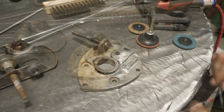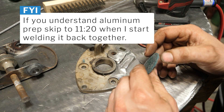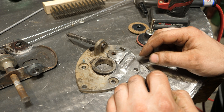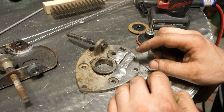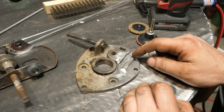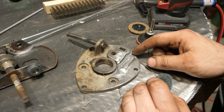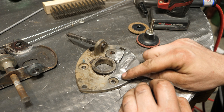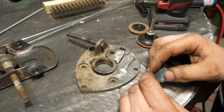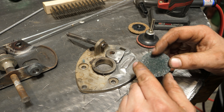Let's talk about some common ways to clean this. The first step is to clean the part completely — I tend to use something like Windex or acetone and scrub the absolute hell out of it to get as much filth off as possible. Be careful what chemicals you use: if you use chlorinated brake cleaner and take a couple puffs of it while welding, you're going to be a vegetable. Use straight acetone or Windex, clean it really well, give it time to dry, and then weld.